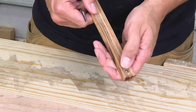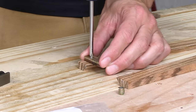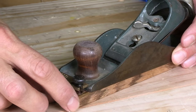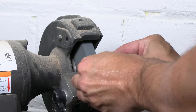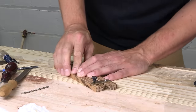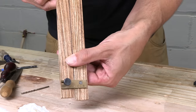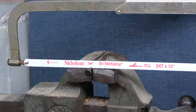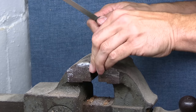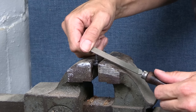Now my threaded insert fits, and I can install those bronze pieces with the included screws. At this point, I'm totally positive I built everything correctly. But this thumb screw doesn't quite tighten down. No problem — I just went over to the bench grinder and took off a little bit of length, and then cleaned up the end with a file. I had the same problem with the rear thumb screw, but it stuck out quite a bit more. My plane might have a thinner sole than most, so you won't necessarily have this problem. If you do, screws are easy to cut with a common hacksaw. Just like using the grinder, the end of the screw will be ragged, but you can work that end with a file at an angle to give those threads a clean start. I promise, it's really easy.